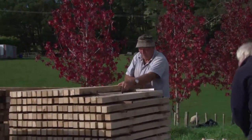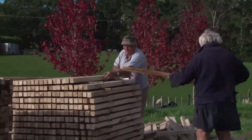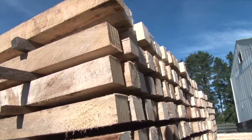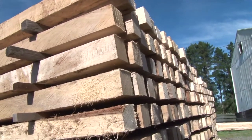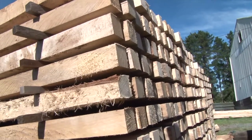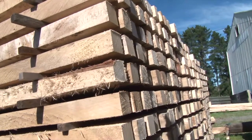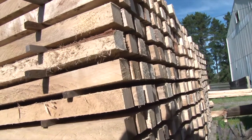air to circulate. It's been found that poplar is the fastest drying of all timbers. In fact, it can beat pine in the summer by quite a few weeks, and with summertime heat and wind, one can get a batten down to 20% in 3 or 4 weeks.